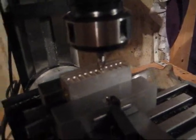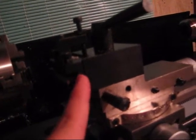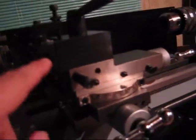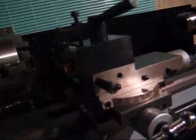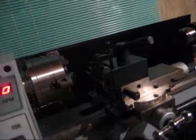There's the block, there's the half inch hole. This is longer than what I need, but you can always cut it off later. This is what we're going to be clamping in - it's 350 thou deep. That's how deep we're going to want to go in, and we're going to want to make it as thick as this. Those are just the two measurements - that's the key boss that you're going to make. So we're going to touch off here and mill off the sides.